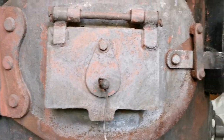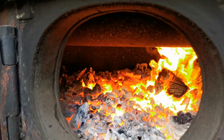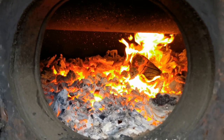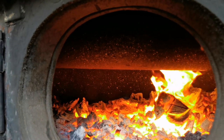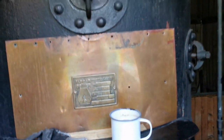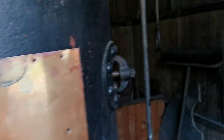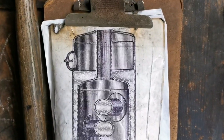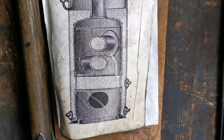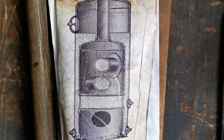If you open this up it allows a little oxygen in above the fire and that helps reduce the smoke. We open up the door — again I need my glove because it's hot — and there we have the fire itself. Now it's a fairly substantial fire pit and you can't really tell the depth. If you look there you'll see a tube running across the top, and that's basically how this boiler works. It's a jacket of water — same as most boilers, it's a jacketed boiler — but this one has tubes running through it. There's a diagram on the wall that we show people. So there's a jacket of water with tubes full of water running through.